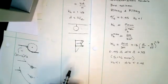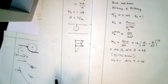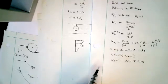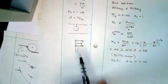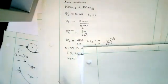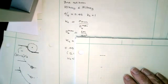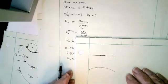Yeah. But the physics of the approximate method are basically correct. They say the stresses that are being concentrated are themselves small. So when you multiply them by the local stress concentration factor, they're not necessarily that big. And bending itself produces large stresses on the outside fibers, and sometimes they're even bigger than the local stress. However, once you get past 45%, that is not true. This KT is bigger. So this situation looks like this. So this weight reduction method probably isn't a good idea whenever there's also tensile or compressive loads.